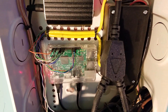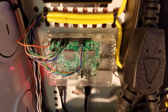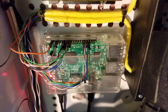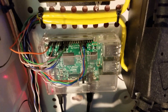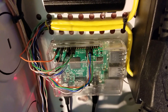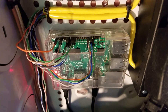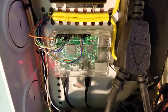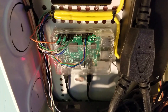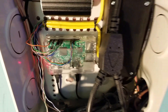As I was developing this system, I thought it would be cool to provide some visual feedback on the health of the system. If you read the Broadcom chip manual, you'll see that a couple of pins on the GPIO start up in a high state as soon as power is applied to the Pi, whereas the majority are in a low state. So if we use certain pins for lighting — in this instance I connected the red control pin to a default high state — when power is applied we get a red glow, and as soon as the OS boots up, all services start, and the Python control script is running, it will fade the lighting from red to green.